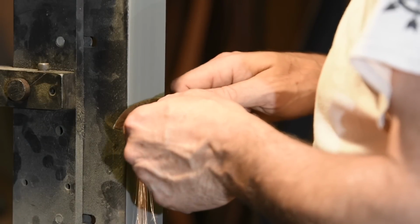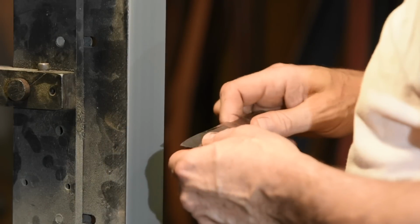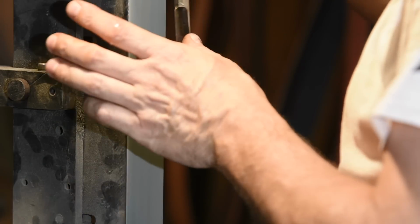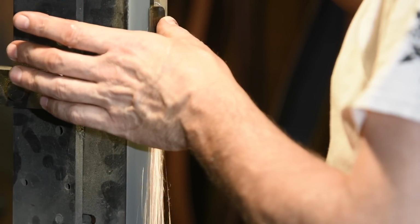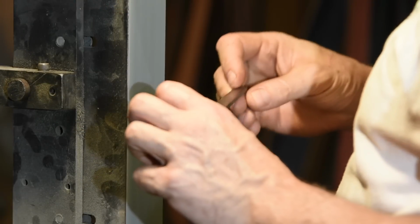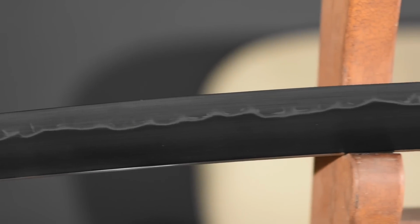And the lesson? Well, first, avoid water quenching at all costs. Even for lower carbon steels that are considered to be water quenching steels, there are generally better solutions. For instance, fast quenching oils like Parks 50. I water quench my Japanese blades, but in a much more complex way than I did here.